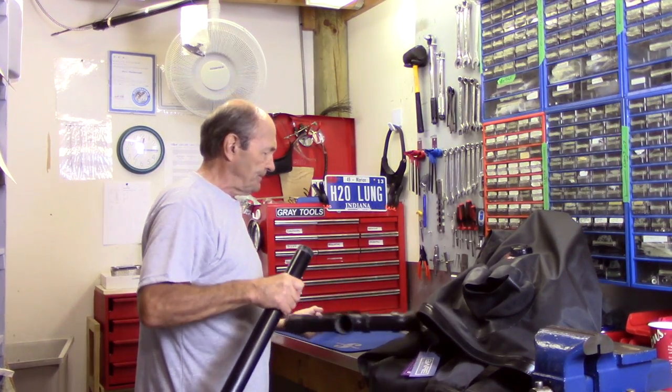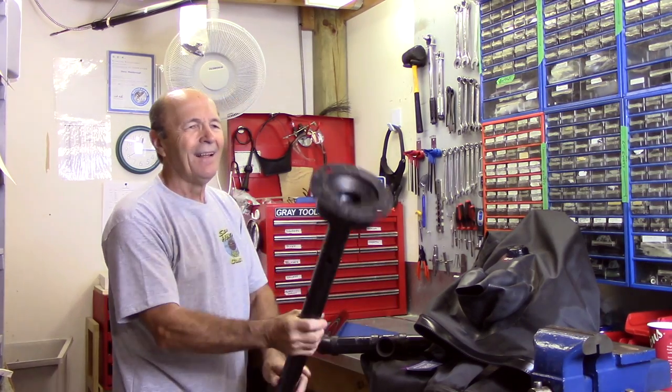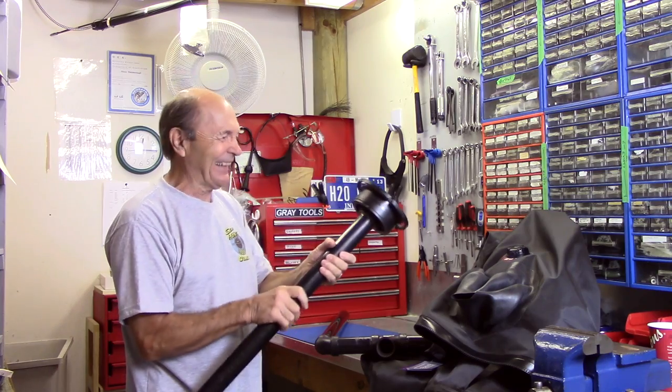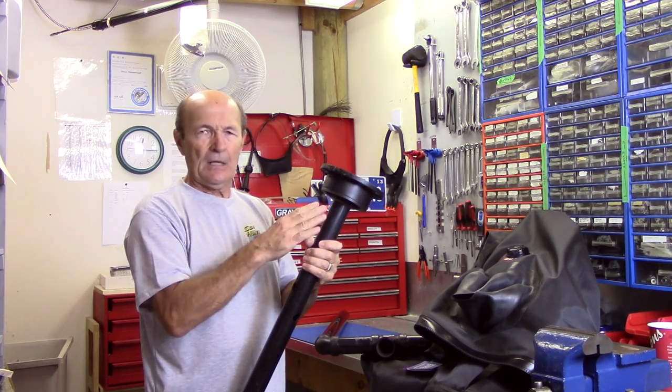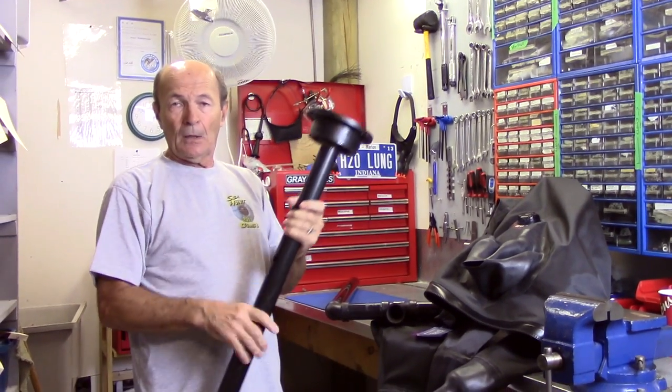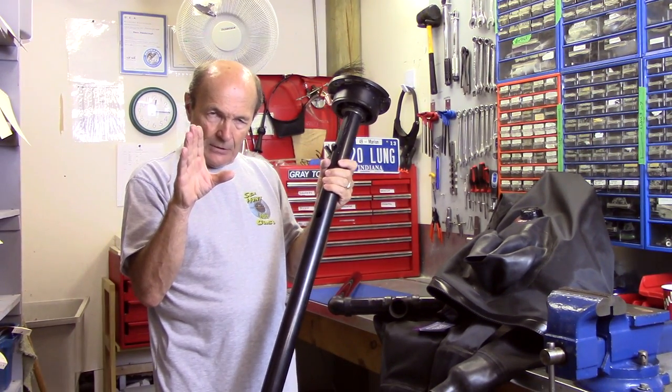Now the flange looks like this. This is actually for a toilet drain, you see? It's the toilet flange that's on there. Okay, doesn't matter. Get this flange. And there's a necessary insert you need too. So it looks just like this. And you just cut the pipe. And you take your time. Now, don't be cutting pipe until you get it all measured out.